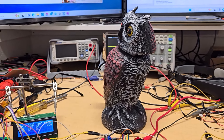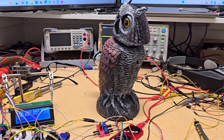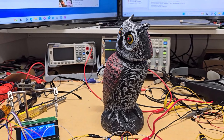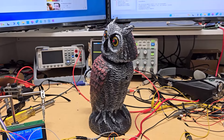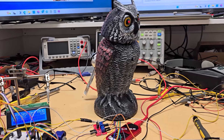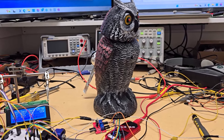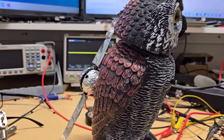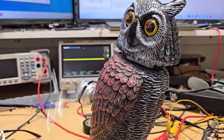That's probably about right. I'm going to try turning the time back down - I've got it at 800 milliseconds, repeating eight times, so 800 milliseconds on and 400 milliseconds off repeated eight times. That definitely takes a little bit of time. Let me adjust that a little more. Alright, that's actually pretty good right here - 400 milliseconds on, 300 milliseconds off, repeating eight times. That's this little burst of the motor.